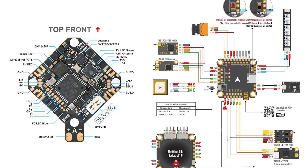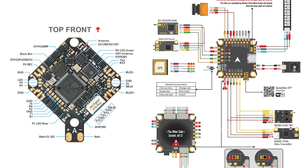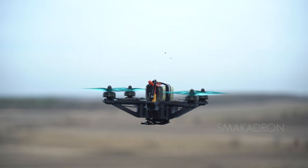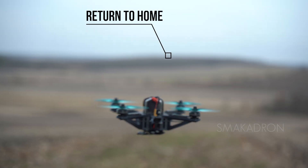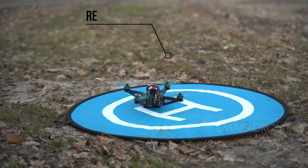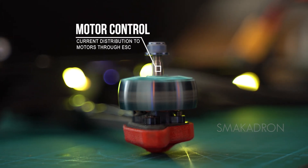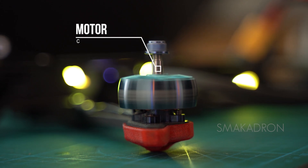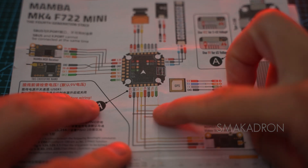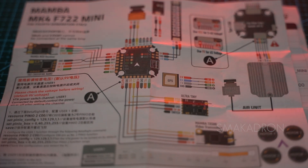While some also offer 9V or 12V BECs designed to power the video transmitter. Although you can power FPV equipment directly from the battery, using the BEC can yield better results. It is important to choose the correct voltage source depending on the device you are powering. For example, a receiver operates at 5V so it should be soldered to the 5V pin. A video transmitter, which operates from 7.4V to 26.4V, requires the appropriate pin for that voltage. This information can be found in the description of the flight controller and by checking the schematics.